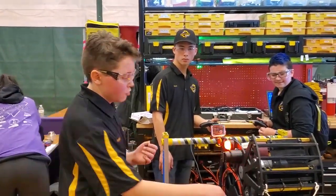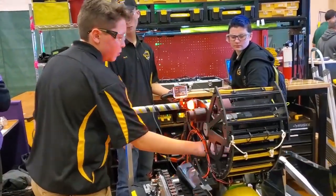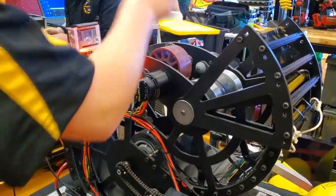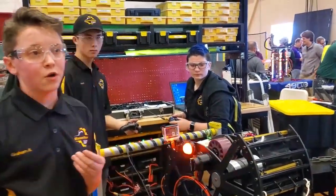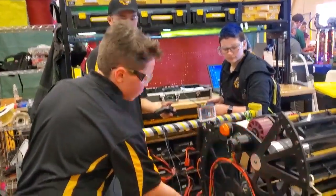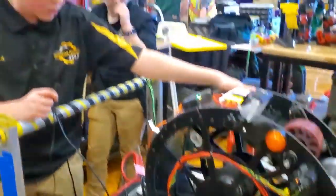Our ball path runs at 7.75 on chains. When powered, the Colson brings the ball up and around, and we have a drive slide on here so the ball moves and slides easier into our gate wheel, which spins it in and feeds it to our shooter — a four-pound flywheel. We're using Falcons and belts to power the shooter. There are also thumb screws here so when you remove them, this whole section can be pushed up to access our PDP and all our electronics.